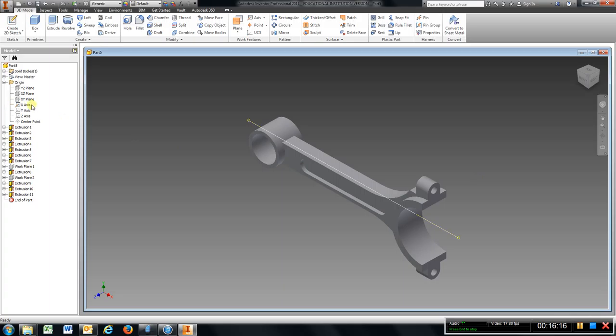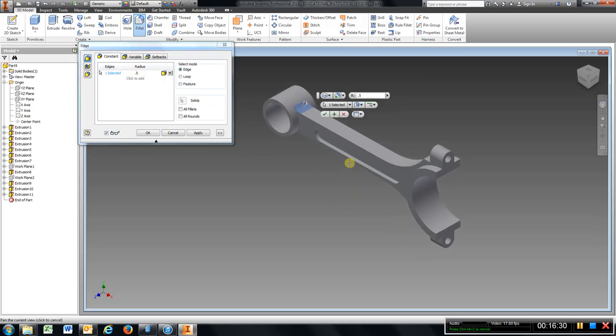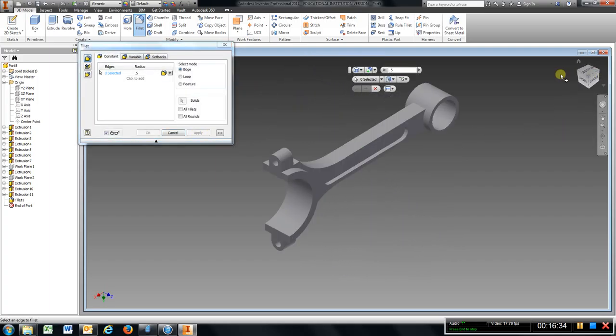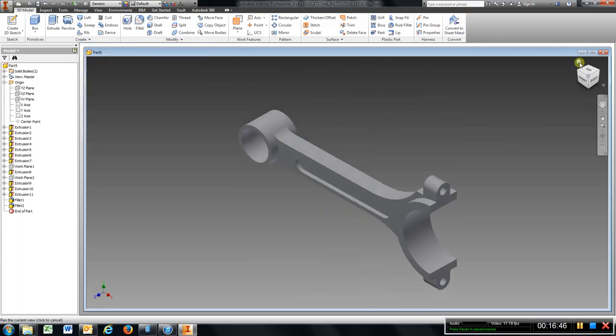I am going to turn off the x axis. Do we have any radius? Yeah — we have to put a half inch radius. Go to fillet, go to .5, enter. Choose that, apply. Flip this over, same thing, apply. I believe that is all — cancel that, go to home. And there you have the connecting rod, which is 7.3.